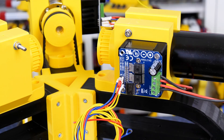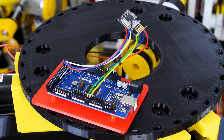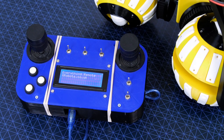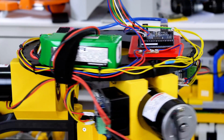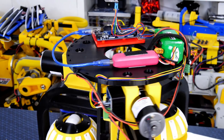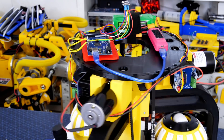Each motor has a motor driver which is a BTS7960 which will more than handle the current we need, and of course there's one of those for each motor. I'm going to be using an Arduino Mega to drive it and I've got an NRF24L01 radio chip attached. I'll be using my Universal Remote which has another Arduino Mega, another NRF24L01, and that's reading the joysticks and switches and sending the data straight over. I've wired 6 PWM outputs to the 3 motor drivers so we can drive each wheel in either direction, as well as power from a 3-cell LiPo. I'm using a USB boost bank to power the Arduino, so now we just need to work out how to code it up to operate those wheels.